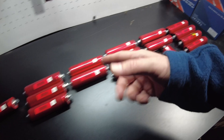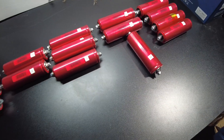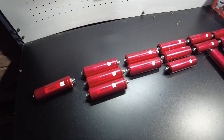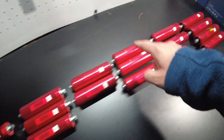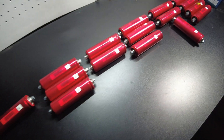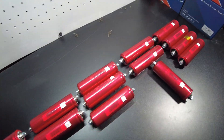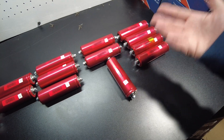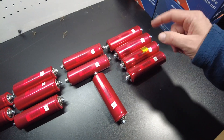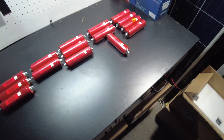If I was to build this into a 16s 48-volt pack, this lowest 7.5 amp hour cell would dictate the capacity of the whole pack. But if you were building a 12-volt pack, you could mix these different capacity cells and blend them together. There's a website you can go to, put in the capacity of each cell, and it'll show you the best way to parallel them to get more energy storage. Same thing with a 24-volt — if you do two in parallel, you could match a low capacity cell with a high capacity cell for each parallel spot and you would get more power.